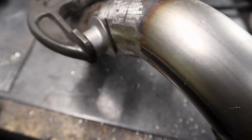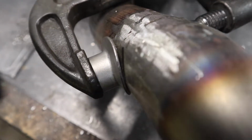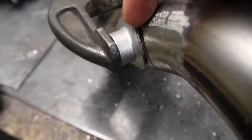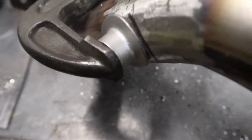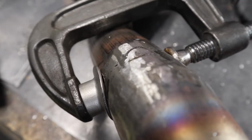Alright, that wasn't a very exciting step drill montage, but you can see how much nicer this curved bung matches up with the pipe. I'll have to fill a little bit on the sides, but it's a way better decision to use one of these if you can spare the time to order one. From a fit and finish standpoint, and from also the O2 sensor penetrating into the tubing. So I'm going to go tack this up, and then we'll put our oxygen sensor in, and I'll be done with this for the day. So, quick small project, but that's one thing off the list.